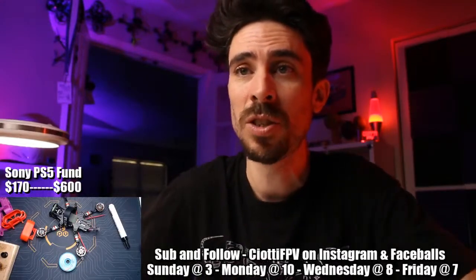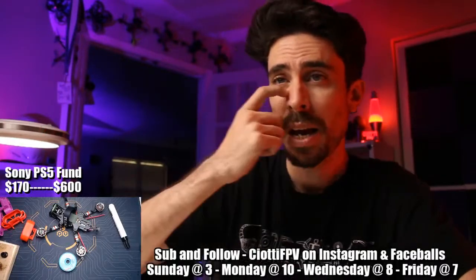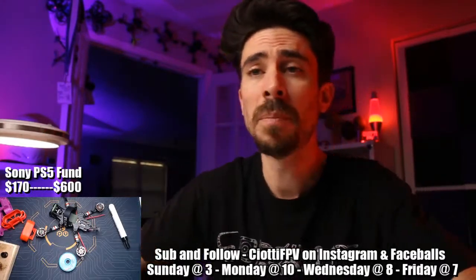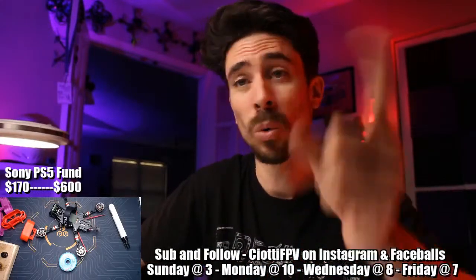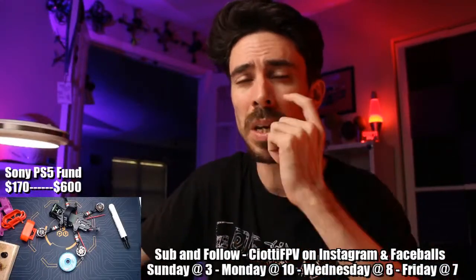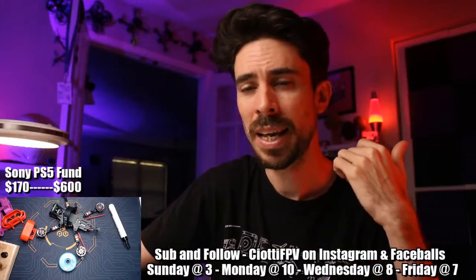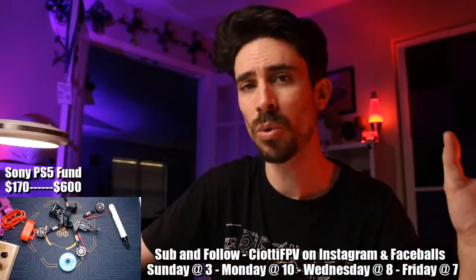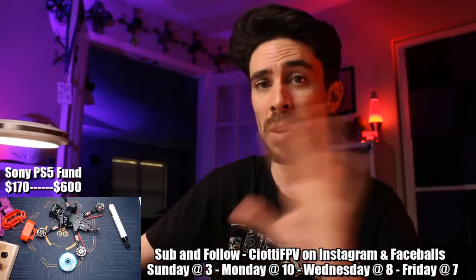Zalku is in the house. He says, did you try INAV for freestyle as a change or even KISS platforms? I've never tried INAV. I did spend a month or two, a couple of years ago, only flying KISS and Flight 1, and I was extremely underwhelmed. The easiest way to think about KISS and Flight 1 is that they are just old school PID controllers, very similar to Betaflight 3.5.7 and earlier.